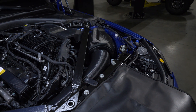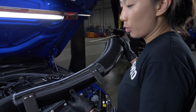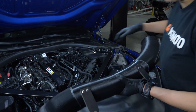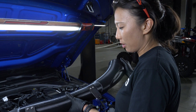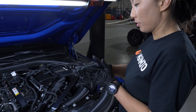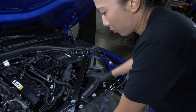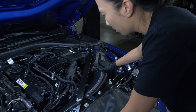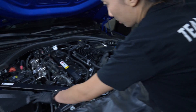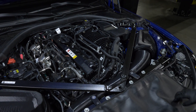It's not just a bigger diameter — the cross-sectional profile of version one is a circle, but version two we flattened it to get more cross-sectional surface area. The oval is oriented vertically, so the intake tube is taller rather than wider. We have a strut tower bar that rides across on top of the air boxes, so one challenge we face is making the two intakes, which are completely different in geometry, match each other aesthetically. The top surfaces are exactly mirrored, and we also mirrored the cutout to go around the strut tower bar.